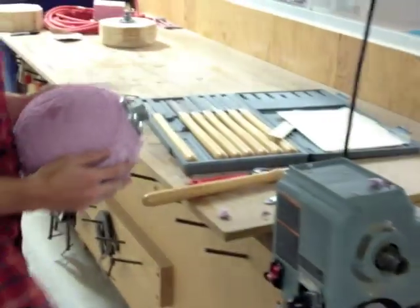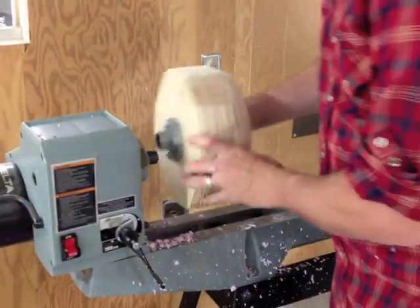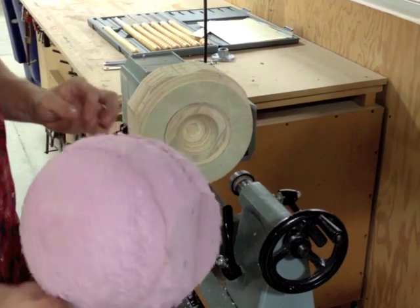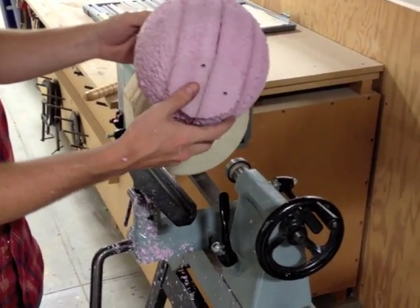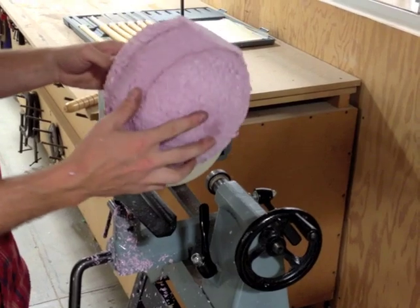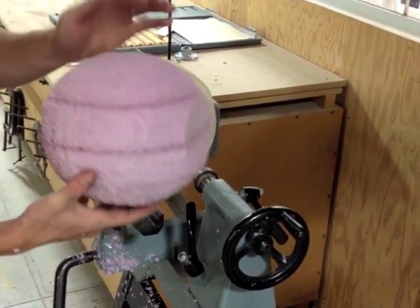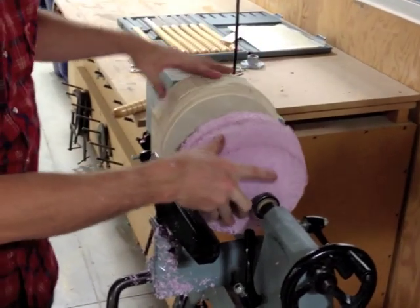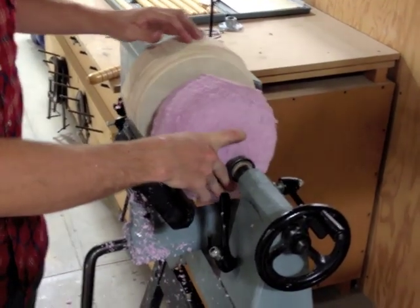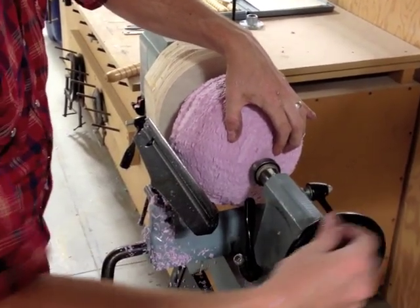Now I'm going to remove this plate with our wrench. So now this wooden cup has been attached, and we're going to take the part of the sphere that has its three holes from having been attached by the plate. We're going to turn it 90 degrees so now we're going at that other axis. We're actually going to seat the spherical part into the cup, making sure it's seated evenly. Find a spot where it's nice and cupped and you'll be able to tell it's balanced. Once you've got a nice balanced part, we're going to move in our support and tighten that up.